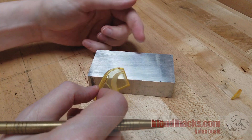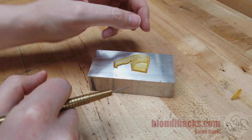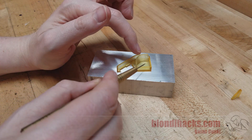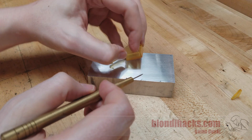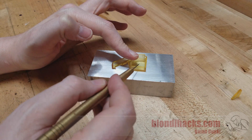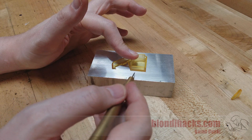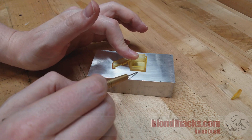Here's how I propose to do that: I'm going to take this piece of aluminum and machine the top as flat as I can possibly get it, then lap it as smooth as possible. That will allow me to place the part on there and — if I do it right — I won't need any sealant because the mechanical interface will be tight enough. I can then build up the sides, pour silicone in on top, let it cure, and pull it out to get my flat-top silicone mold. The silicone needs to be right up against the surface without any adhesive, so I'm going to leverage the power of machining to get a high-quality surface-to-surface connection.